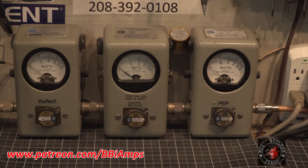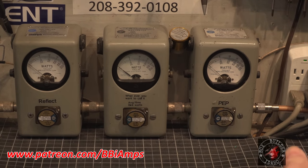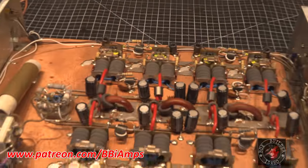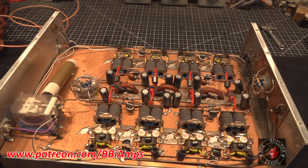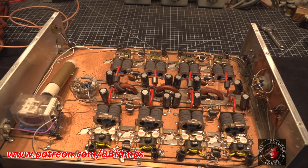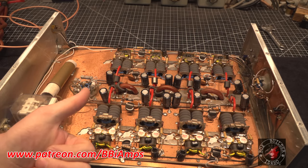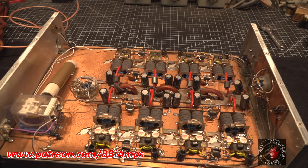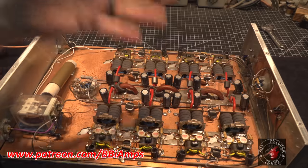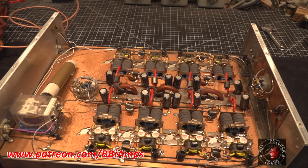So we're making about 200 watts, 150 watts worth of power with about 20 watts going in. So this comes down to capacitors and transistors that we have managed to send on to God. And really what that falls down to is shoddy solder work, solder splash, and people always change the transistors, but they never check the capacitors.